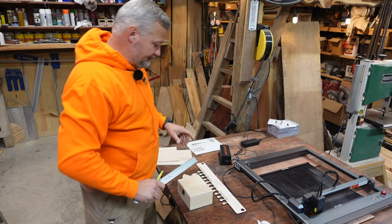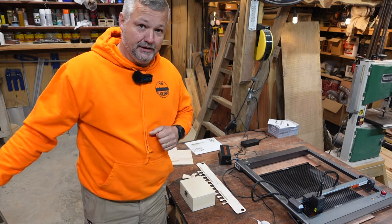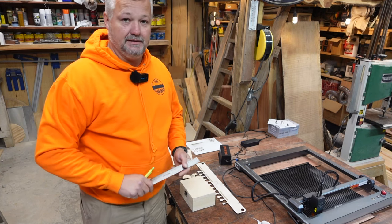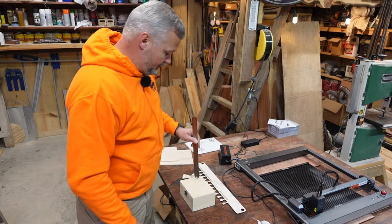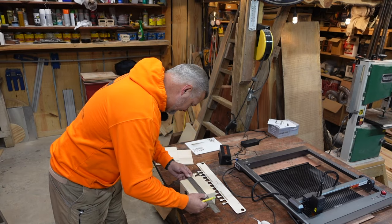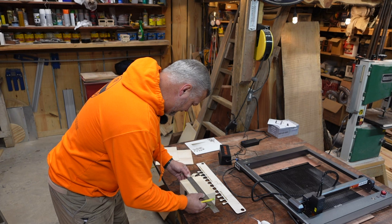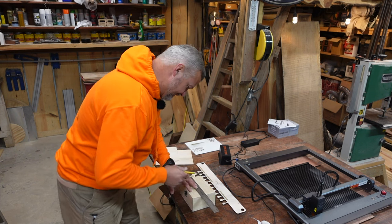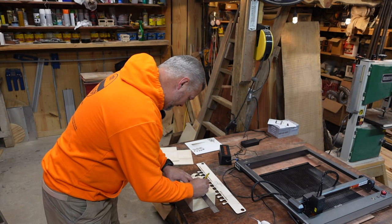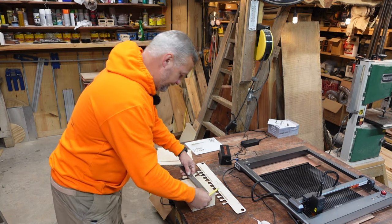If I get it in focus and try to frame or move outside the workspace, it's gonna hit. The first thing I'm going to do is set this up and start the engrave on the outside. Before I can do this job, especially the way it's configured, I have to know where the center of the box is. I'm going to measure the top of the box for alignment of my exterior graphic. This thing is two millimeters shy of 170, so I'll just split a millimeter on each side to avoid any math - that'll have me at 8.5 centimeters to the center. I'll make a really faint mark with this mechanical pencil.